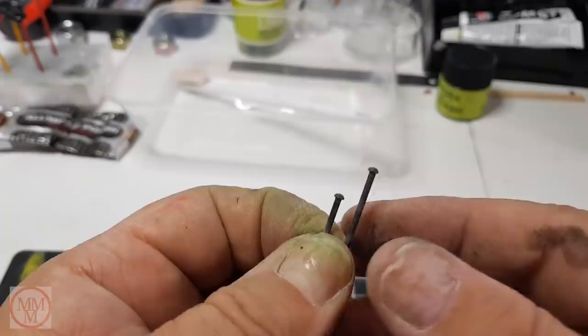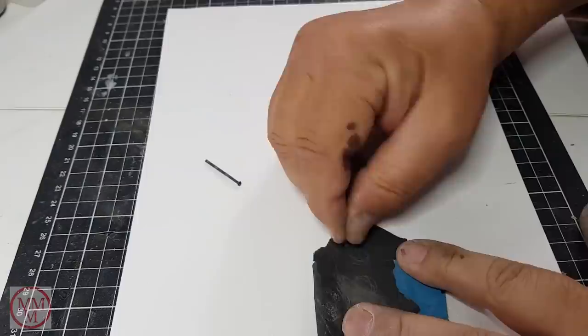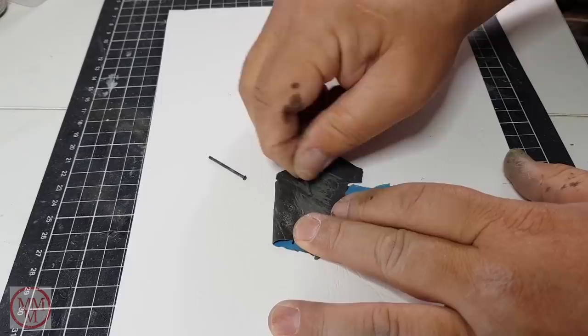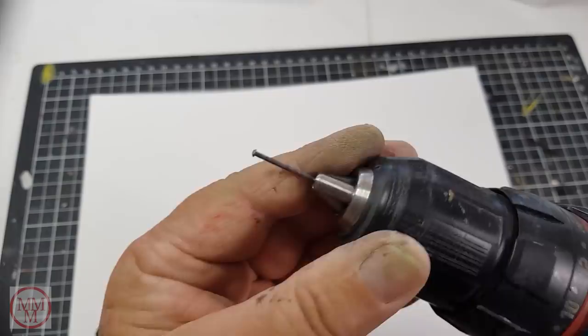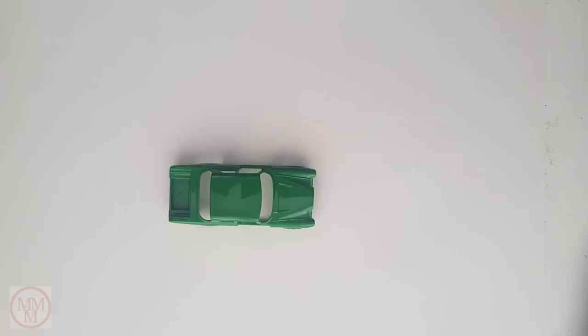These axles are the only thing left to do - they are a little bit corroded and dull. So I use some very fine emery paper and just rub away until they become shiny. Once I have done the ends I have to do the shaft, and I use my battery drill for this. I grip the shaft with some emery paper, just spin it up, and look at that - it comes up like new.